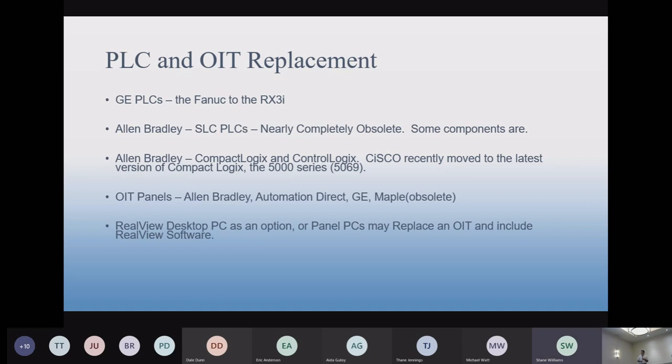The general purpose stuff is covered by a wall. Data loggers. We do replace data loggers on occasion. There was a time we did it quite frequently, and now it's calmed down a little bit, but corporate policy can motivate that change. We've got a good method of changing out the data logger. You don't have to clean up their wiring. You use their connectors and connect to a set of connectors that we make, pre-wired to the PLC, so it's very simple.